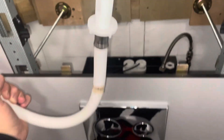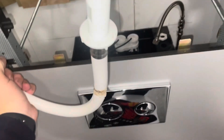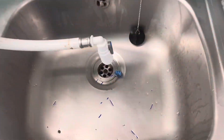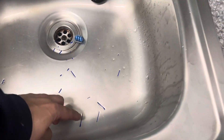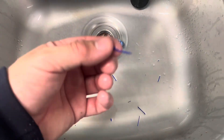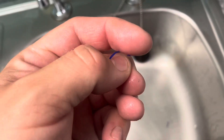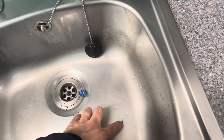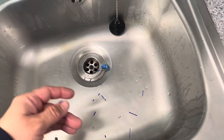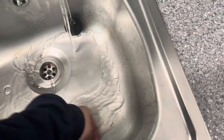This also has a filter in it on the inlet — as you can see, it's covered in the same stuff. There's more of this blue stuff and bits of grit that have also been dragged into the system from the water main, and they've made their way up to this toilet. Because it's a well-used toilet, I think it's going to have all the parts catching here and it's also got a good filter system. I don't know what it is but it breaks up really easily, so I'm just going to clean the filter and put it all back into the system.